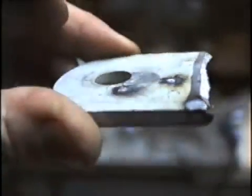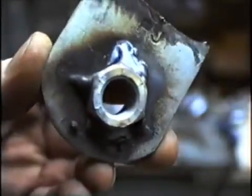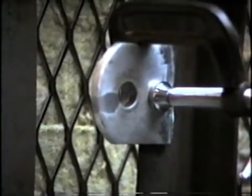Here's what I've done: I've cut about 2 inches off the end of these brackets and welded the nut onto one side. I've put the door in position now so it's sitting on the sill block and I've put a couple of magnets there to hold it in place while I'm working on it. I'll build the entire door opening mechanism while the door is sitting in position. I've temporarily clamped these brackets in place with the nuts welded on the back, and that's what the rollers will be bolted into.